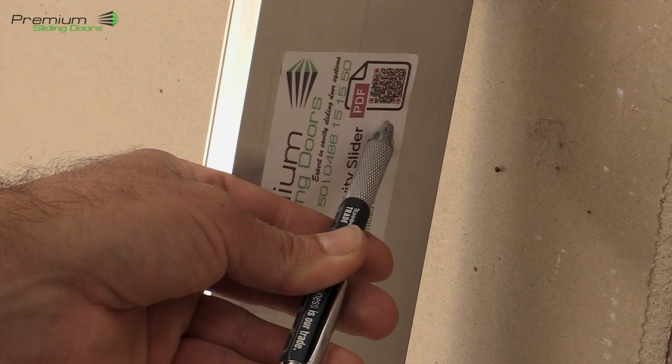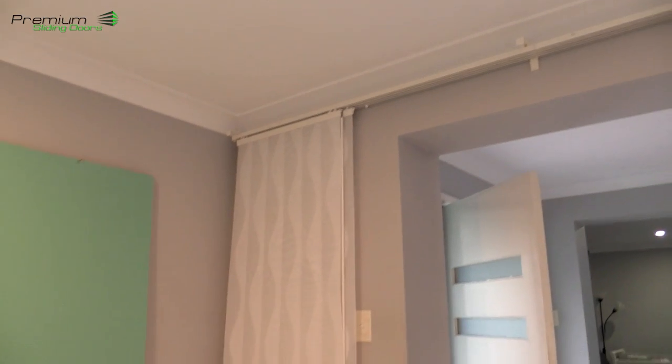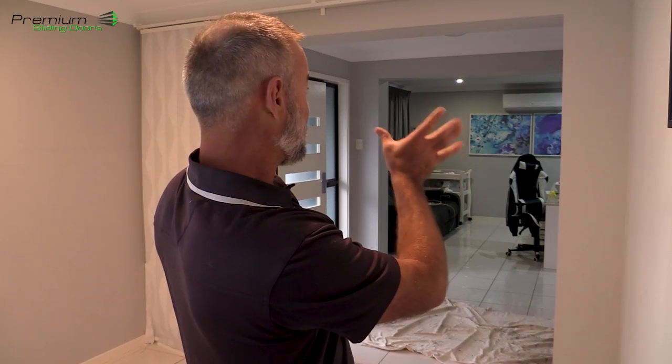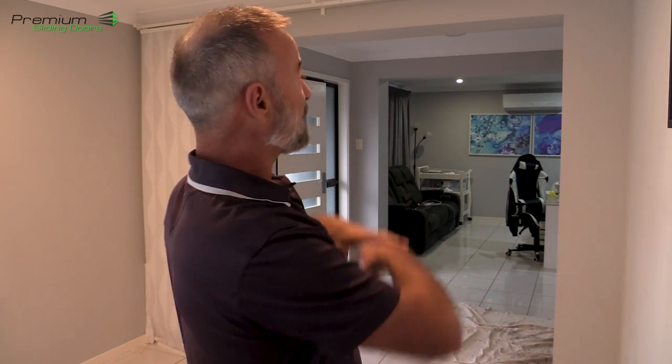So this is our project — basically this is my customer's office, and because this is one big opening it didn't offer much privacy or any sort of acoustics for sound. You can see in the back there all that was is that little slide-across screen. The whole idea now is to put these double cavities on each side, build it all in, replaster the wall, and have it all finished so it looks seamless like those doors were supposed to be there.